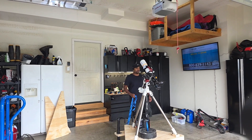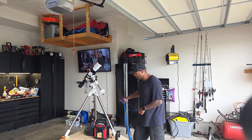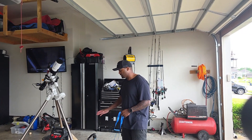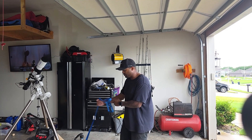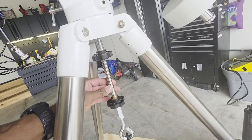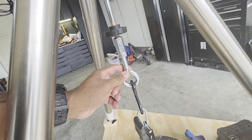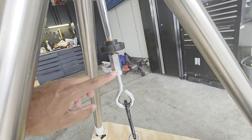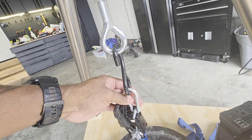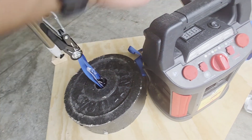I don't think I'm going to have any real problems pulling this around my yard. In the future, I want to add a wagon-style handle that lets me articulate side to side — right now I can't push back. The little bar here turned out to be metric — M12 — so I got an M12 coupler, and I shoved a half-inch in there since I couldn't find it in metric. It's not coming out, which is kind of the point. I got a ratchet strap, used a carabiner since part was too long, and anchored it right into the cross member going across this way.